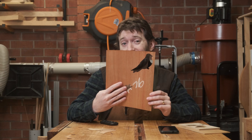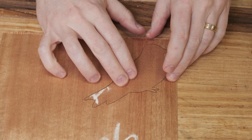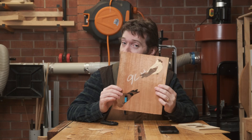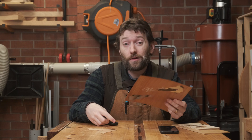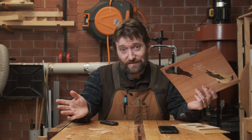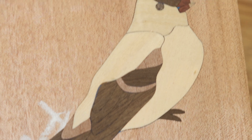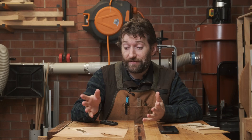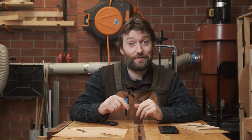The first background I cut out, I accidentally used the wrong vector line, so the cutout ended up about 2mm larger than it should have been. The second one was a much better fit, though I still need to properly account for the kerf — there are online generators for test patterns to figure that out. It's a pretty good result, but for marquetry it could be a little bit tighter. The possibilities are really exciting to me though — I think I could do a separate video just on laser marquetry, maybe throwing in some light engraving for stone inlay too.